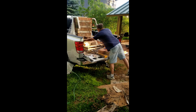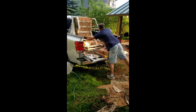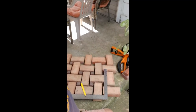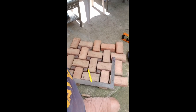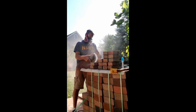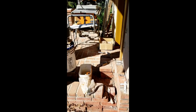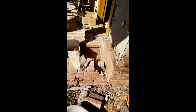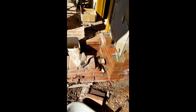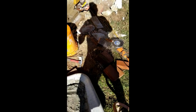I got a skid of bricks - three in all for this project. I wanted to put a hose bib here, in the area we're going to use for the feature area, the potting shed. The white pipe is for the hose bib. Now I'm just going to wet down the whole area and some of the bricks I'll be using. That's important on a dry day to keep the brick from sucking the water too quickly out of the mortar and making it dry without allowing it to bond.